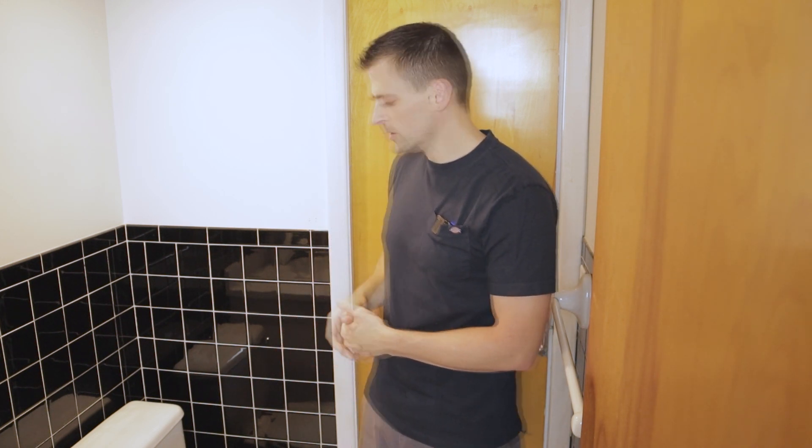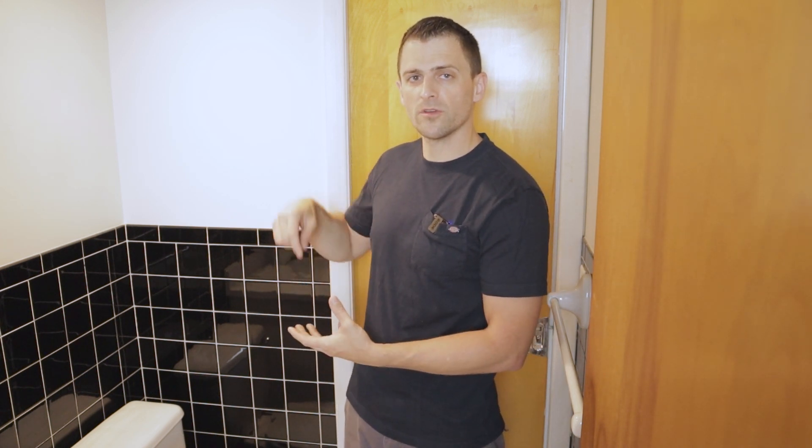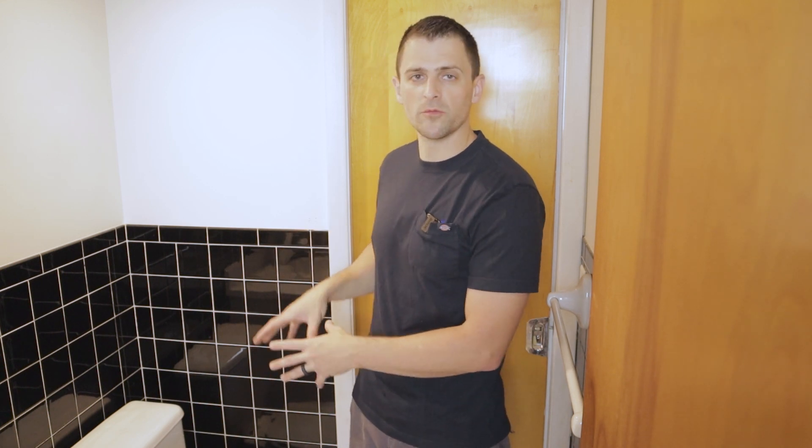We're also going to be adding some material underneath the subfloor, so I need longer screws to go through the toilet flange and into the subfloor. I need to know what length screws are in there now so I can go longer into the new material we'll add underneath. We won't know any of that until we get this toilet removed.